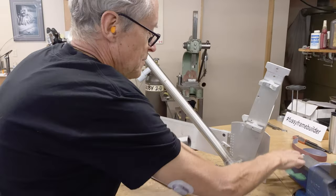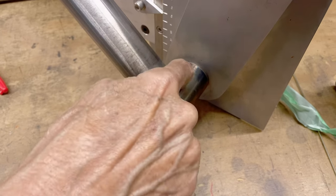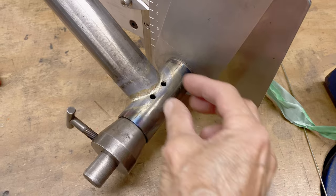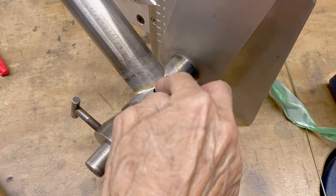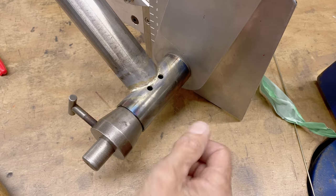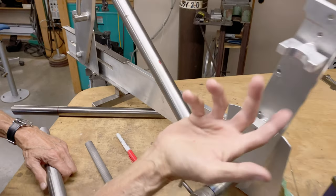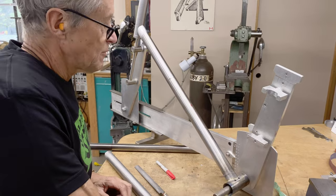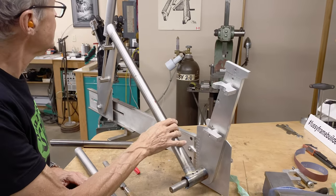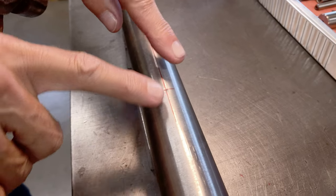One thing I have to do now: since you were gone, I did some nickel silver here. Can you see how I nickel-silvered a down tube onto the bottom bracket? I also drilled a couple of holes — that's for the seat tube, so that if water goes down the seat tube it's got somewhere to go. It doesn't just sit at the bottom and rust out the seat tube; it goes into the bottom bracket and then you can empty that. I'll put a drain hole on the bottom. And we have to drill the holes now for the water bottle bosses — it's much easier while this is just a tube I can hold. So we're going to center punch, use a center drill, and we need quarter-inch holes. You can actually probably see that — there's a little bit of a shadow, and that really helps when you have to use a center drill.